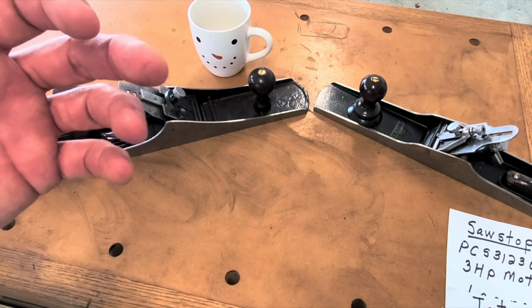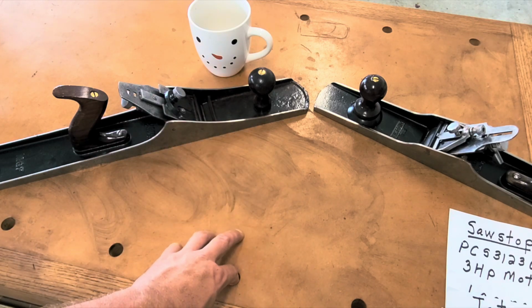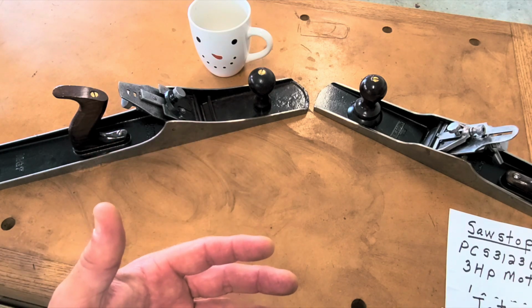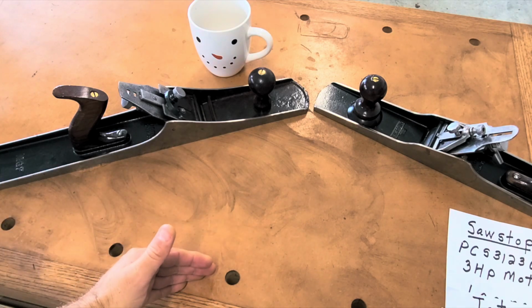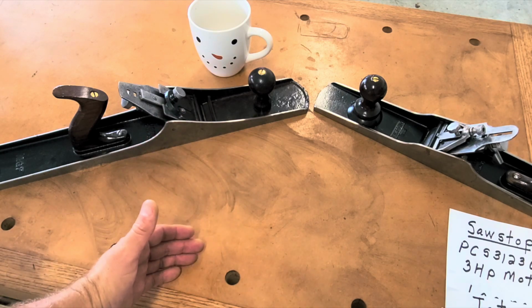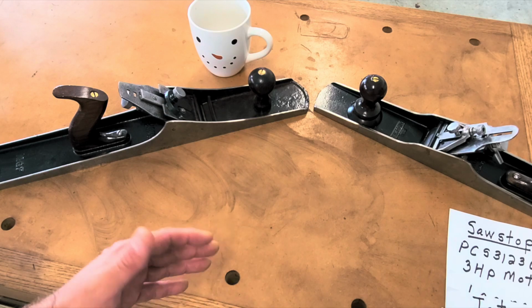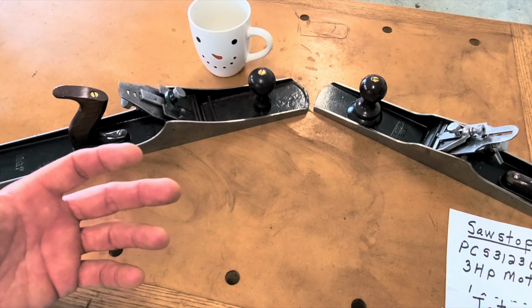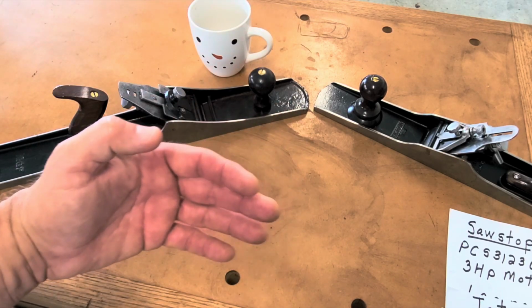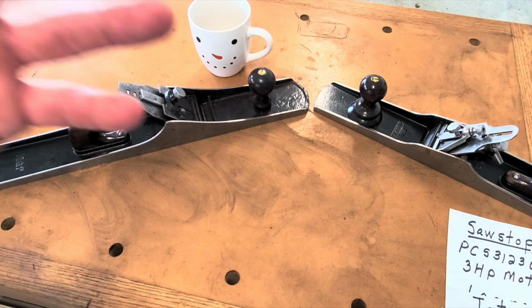One thing I noticed is that even when people have a SawStop, they do not use the blade guard, and I think that's setting you up for problems down the road, because it can lead to complacency. Anytime I'm using the table saw, or even the table saw function on the Shopsmith, I always use the blade guard when doing a rip cut. If I have to do a different type of cut, then I'm going to figure out some type of work holding or jig that keeps my hands away from the blade. In fact, I've gotten to the point now where if I don't use the blade guard on the table saw or the Shopsmith, I just feel like I'm not using the tool correctly. So I like keeping that as a good habit and a good safety practice.